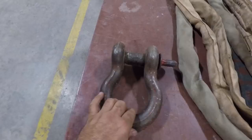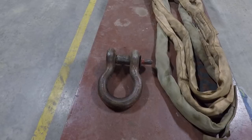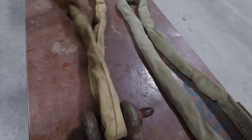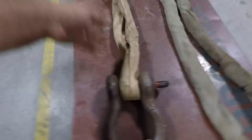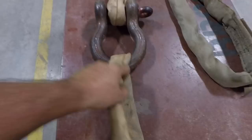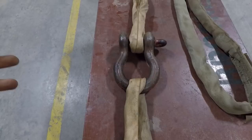His other question was: if you have the shackle involved in some rigging, does the pin have to be towards the hook? I'm going to put some rigging in the shackle and show you. I've got one strap over the pin and one strap coming out of the bottom, so the load is between our two marks and pulling straight on the shackle. In this situation, it doesn't matter if the pin is at the top or bottom because the shackle is seeing the same load regardless.